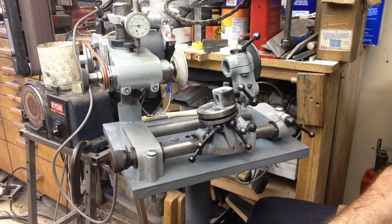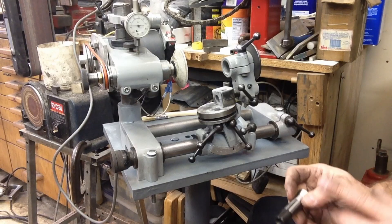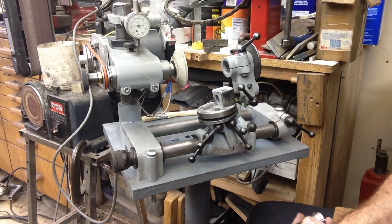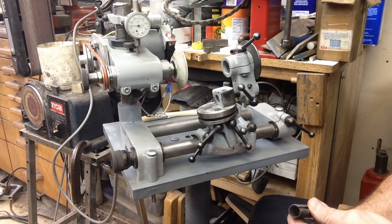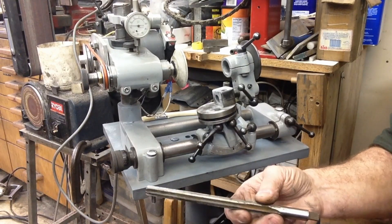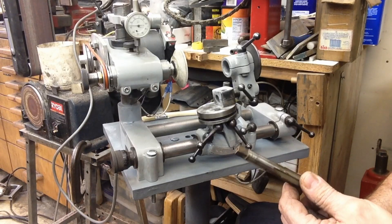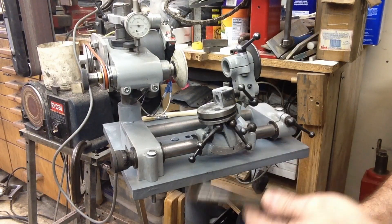What I did is I drilled it out as large as I could with a smaller drill bit, just chucked it up in the lathe. Nothing precision here — as long as we've got clearance and don't interfere with the holding up front. Still wasn't quite enough clearance. Going through my old reamers, I found I actually had three of the same size — 0.2713 to 0.2714 — different manufacturers, one already sharpened, two still original size.